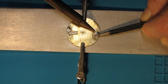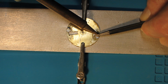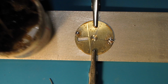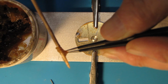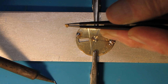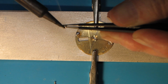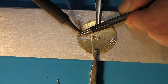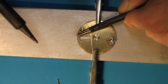After that I begin to solder dial feet one after another. I want to say that this method should be used very carefully, applying the heat by soldering iron for as short time as possible. It might be wise to try this operation on the spare dial to get a feel of the soldering method. If heat is applied for too long, it could damage the delicate dial face.